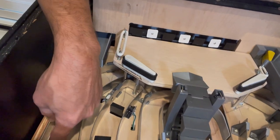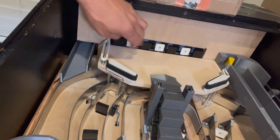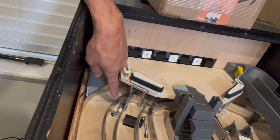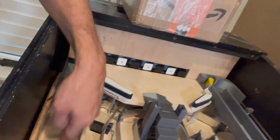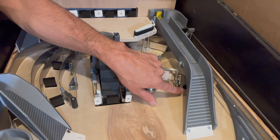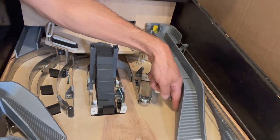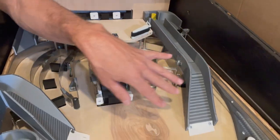I might also need a second switch up inside here so the software knows when the ball is coming around as an orbit shot versus coming down off the tray. I need to make sure I can differentiate those two. So we're going to hurry and bust through adding all of those right now.